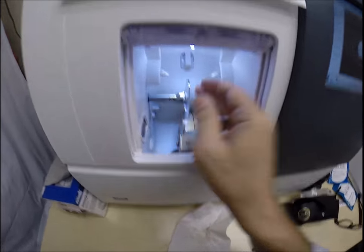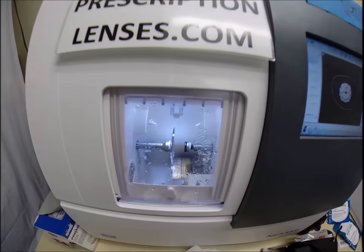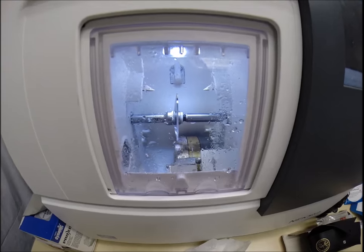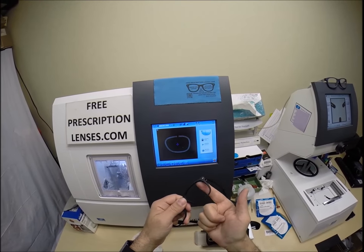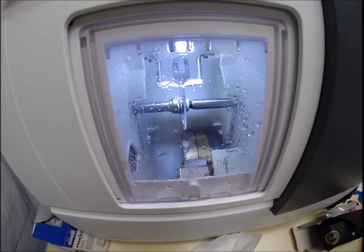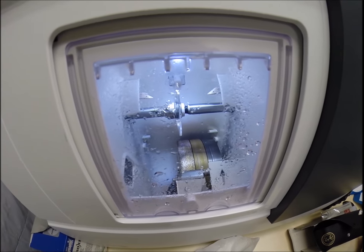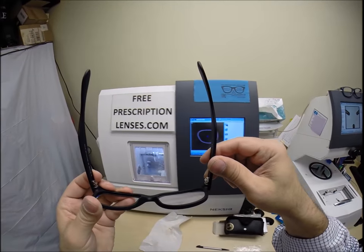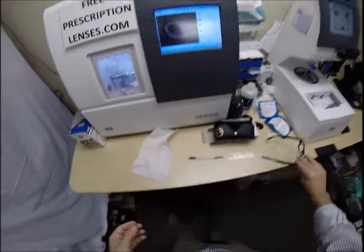I'm putting the second lens into the chuck and hitting the arrow — the door is going to close, the clamp is going to shut, and the lens is going to be traced again by the two white styli, making sure it's large enough to fit. It measures the thickness to know where to place the bevel. You have no edge thickness in this frame, but when I cut prescription lenses all day at very strong powers, placing the bevel becomes more critical.